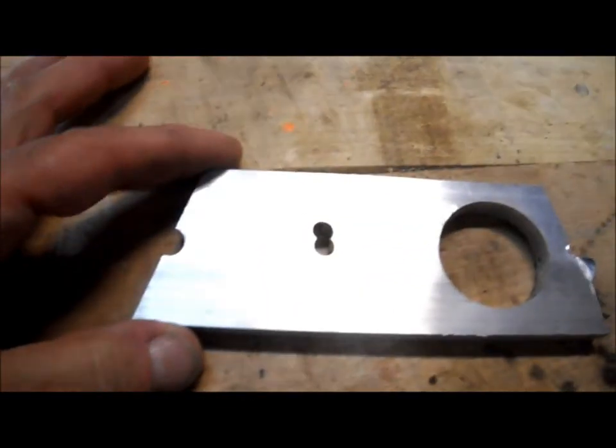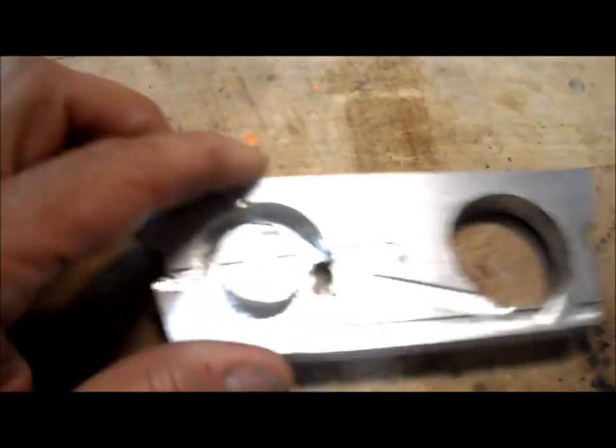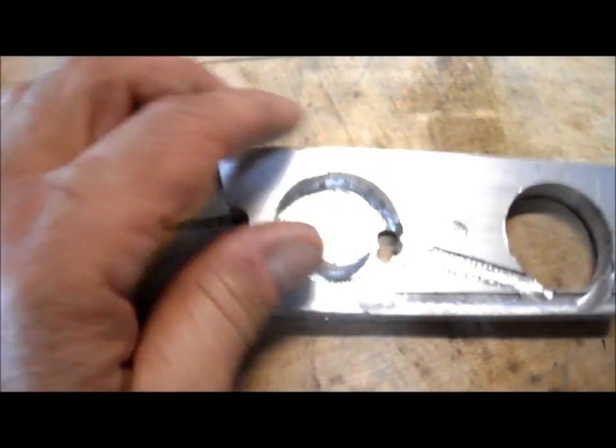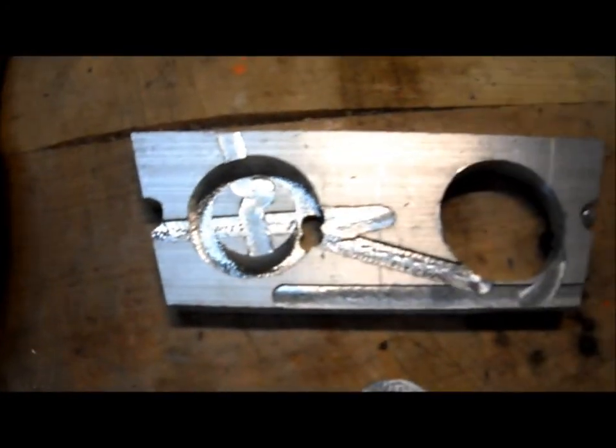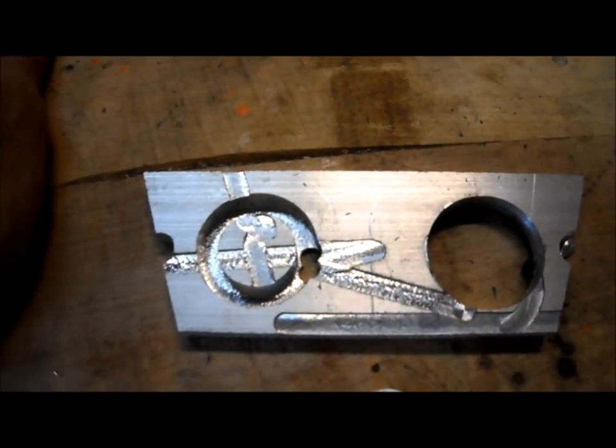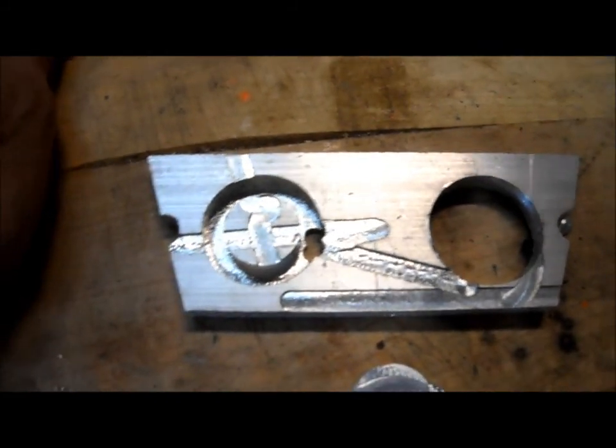Take a look on the other side. Looks like there's a little bit of chatter too — you can see the way it's going. However, for an exhaust flange, or an intake manifold flange, certainly that would do quite nicely. Just letting the machine do its thing and getting out of the way. The amount of time it would take me to do it by hand — laying it out, drilling and boring and then finishing it off — is considerable time.